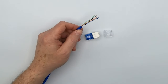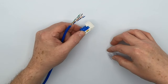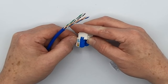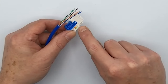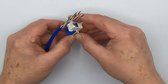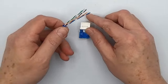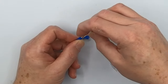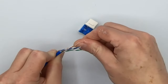The next step is to take your jack. We're going to be working with the B sequence. In this particular jack's case, the B sequence is going to be with the green and the blue pairs first — they're going to be towards the RJ45 port part. The side here is green and this side is blue. Take a look at your cable and organize it in such a way that it makes it simpler to terminate your jack. Turn the cable over so the green aligns with green and the blue with blue.